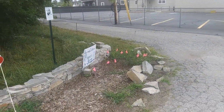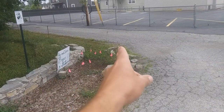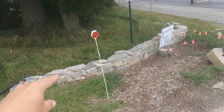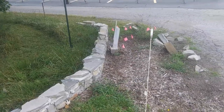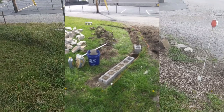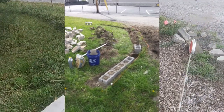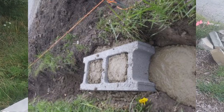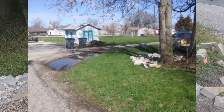So when I moved in a couple of years ago, this wall wasn't here, and this corner would kind of get cut off. I thought last year that I would build this wall — I'll put in some pictures here as I talk. First I just dug out a trench, put in some cinder blocks as a base, and I did cut some of the roots. But some areas I actually just filled in with concrete mix. Then I got a load of limestone from a local supplier and started stacking them.